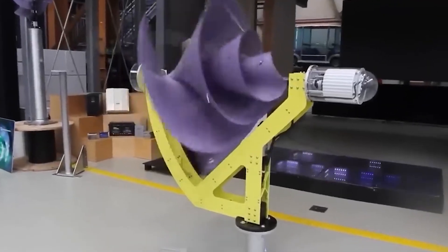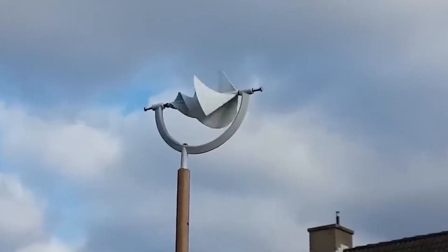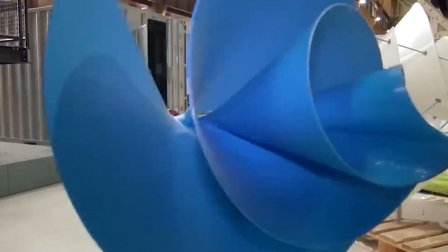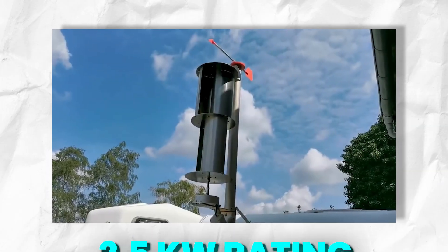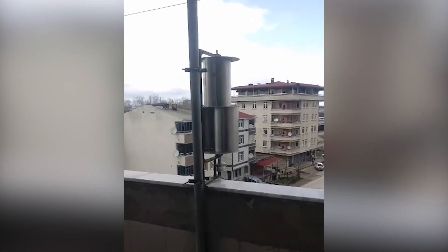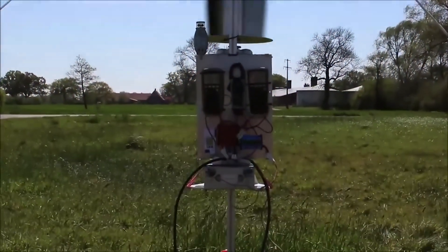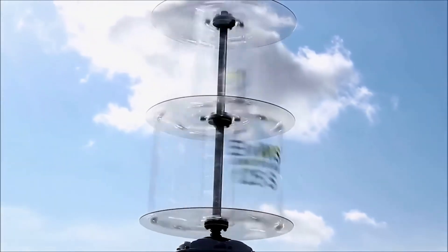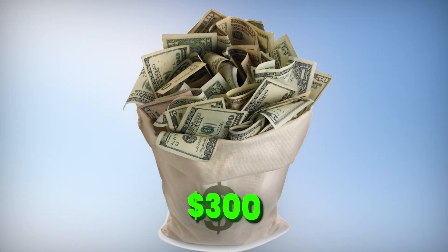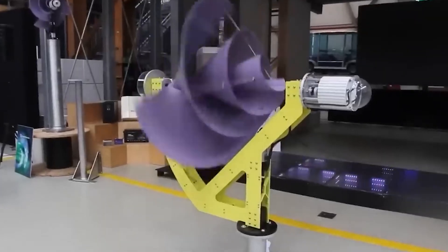What are the actual cost savings from this wind turbine? After over six months of operation, energy production data reveals it meets or slightly exceeds ELVWIS's own specifications. Starting electricity generation at around 7 mph winds, under ideal conditions it logged a maximum output just above its 2.5 kW rating. On a monthly basis, energy production ranges from 200 kWh during calm summers to 350 kWh amid windier winters. All totaled so far, the turbine has yielded over 1,500 kWh of clean renewable electricity. Factoring in local energy rates and incentives, annual electricity bill savings should amount to around $300. With an installed cost of $15,000 after rebates, a 20-year payback period seems feasible, assuming electricity prices remain stable.